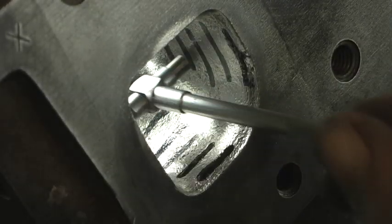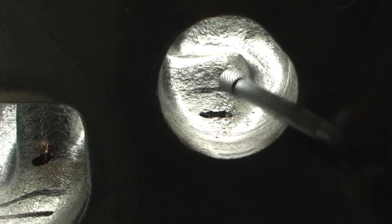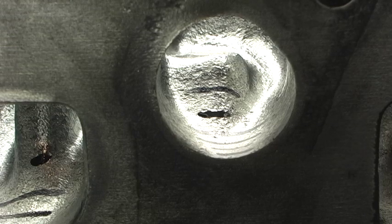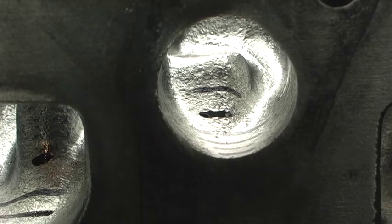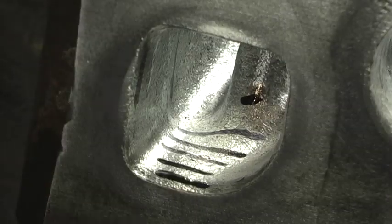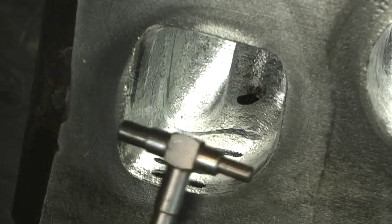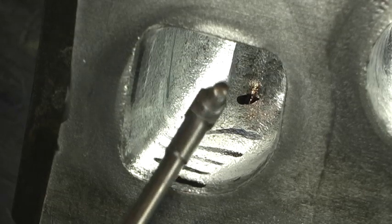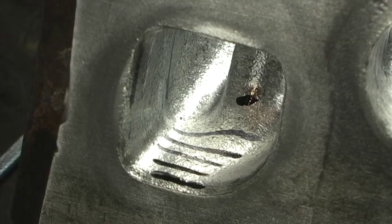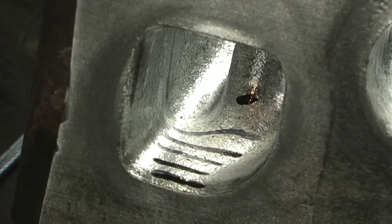That's how I even out some on the guide, to try to put the cross-section of the guide in there. I usually hit it within 10% of the guide area to get a total cross-sectional area. Once I pull the math numbers out of it, I'll break out the sonic checker and hit each one of those spots — that's going to tell me the thickness at each individual plot. Then we can get down to some serious calculations and figure out what we're going to do.